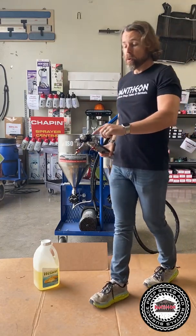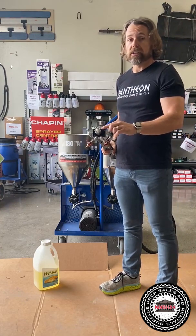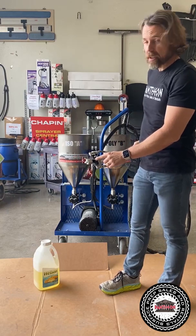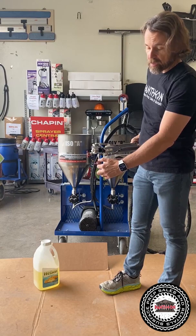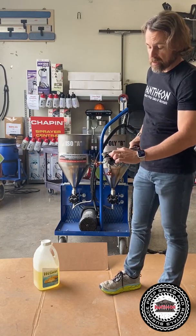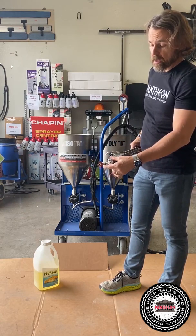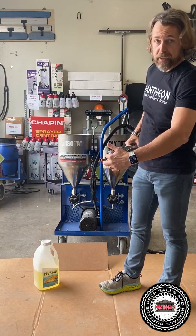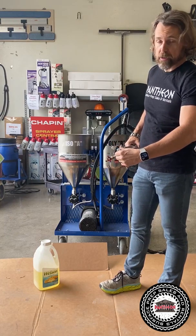After you have the vegetable oil through the lines coming out of the valves, we're gonna grease. We're still gonna grease. It's just always a good habit to grease. So again, we're gonna put the grease gun on here on these fittings. What I do is I open this valve, I push up my grease until it comes out here, close the valve. I do the same thing here, put my grease gun on this fitting, pump it out. And then here on the ends, I unscrew this, do the same thing. I wait for the grease to come out, I get it around my finger, I put it around those threads and then screw it back on.